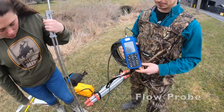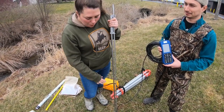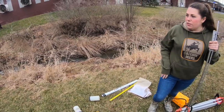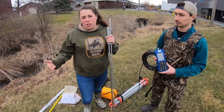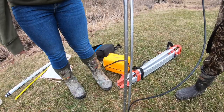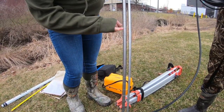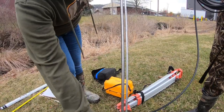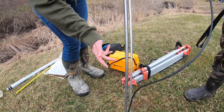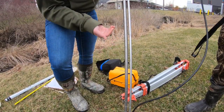The upstream reading is 7.68. This instrument also gives you velocity and water depth, which lets us figure out discharge — how much water is moving through a certain area. When it rains or there are outflows, stream discharge increases. The flow meter stick has lines graduated in tenths of feet: triple lines are a foot, double lines are half a foot, and single lines are tenths. Going up from the bottom: 1 foot, 1.1, 1.2, 1.3, 1.4, 1.5, 1.6, 1.7, 1.8, 1.9, and 2 feet.